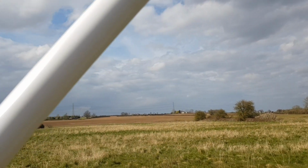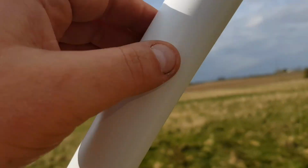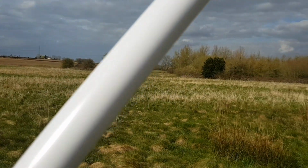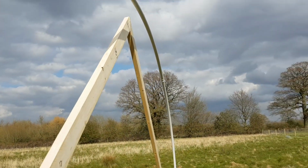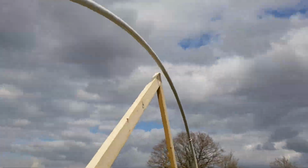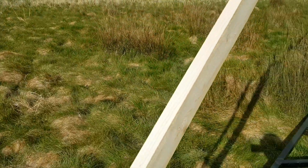And then yeah, when we're connecting each hoop together with a good piece of lath like we've got there on the inside, we're going to add quite significant strength, because we're going to have at least 4 rows of lath, and then we're going to have a centre beam which is going to be 4x2s running all the way along the top of this. So yeah, this should be a nice strong structure.